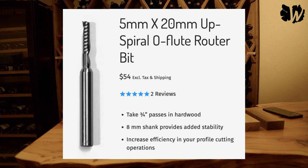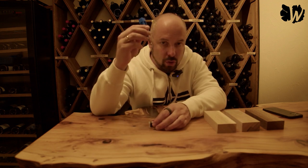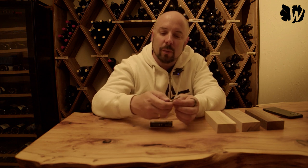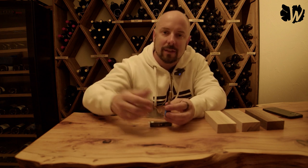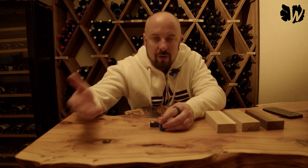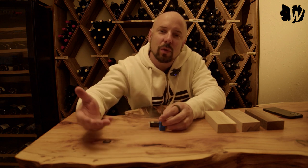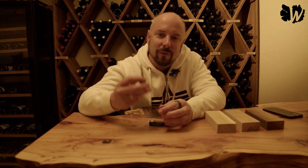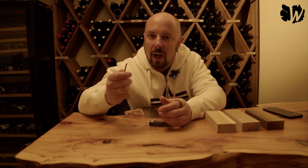It's a 5 millimeter tip and an 8 millimeter shank. It's sturdy and it's supposed to be designed in a way that you can remove 20 millimeters of depth at once — drill in and then just remove all that material at once, and the O-Flute will help to eject that material. According to Shaper you can use that both for soft and hardwoods. Joshua wanted to know if that actually really works, or if you use this on hardwood whether we will just fry the bits and make it all dull and useless.